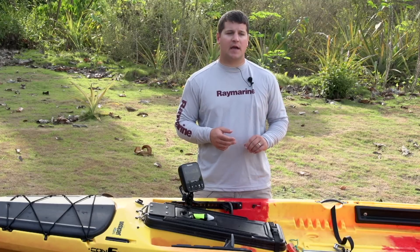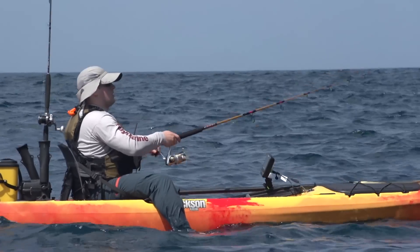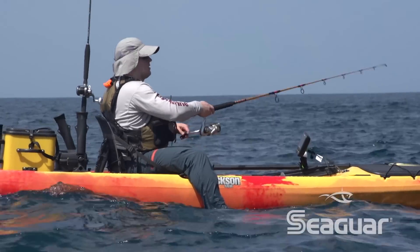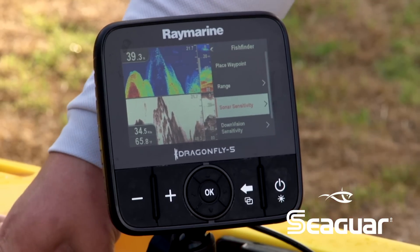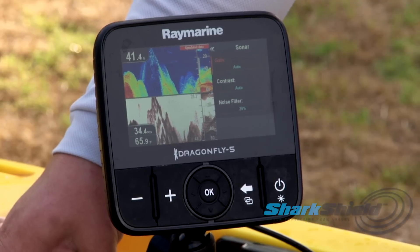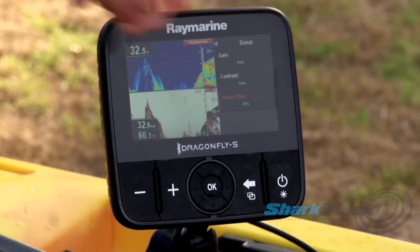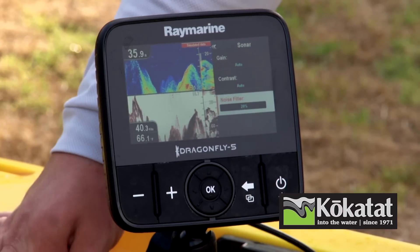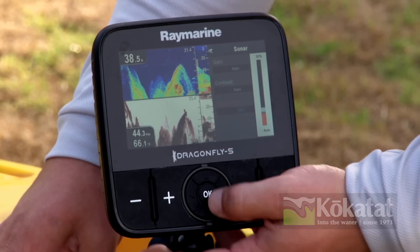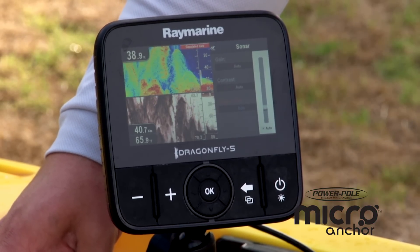The second tip: I've had some feedback where people say sometimes they're out cruising around in their kayak and there's just a little bit too much clutter at the surface, and they're trying to find bait. Well, there's a really simple adjustment you can make on these Raymarines. Go into your menu structure, this time go to sonar sensitivity. Down at the very bottom you'll see noise, which is referencing that line or clutter you sometimes see at the top of the screen. You can go in and manually adjust it by hitting enter, and I typically recommend adjusting it in increments of five or ten percent until you see a nice clean picture.